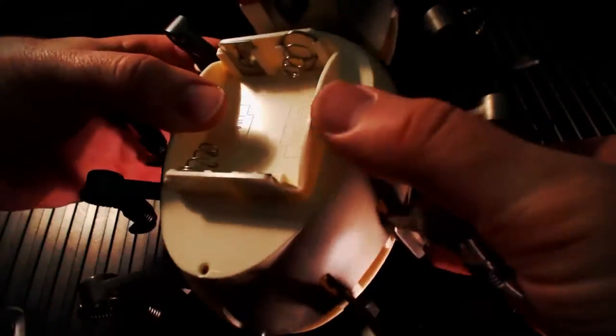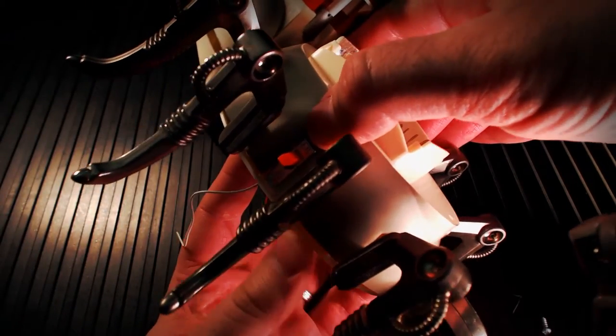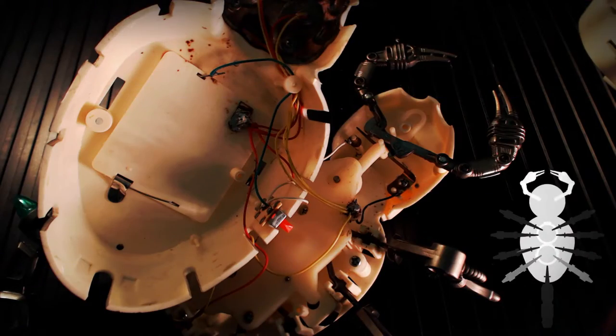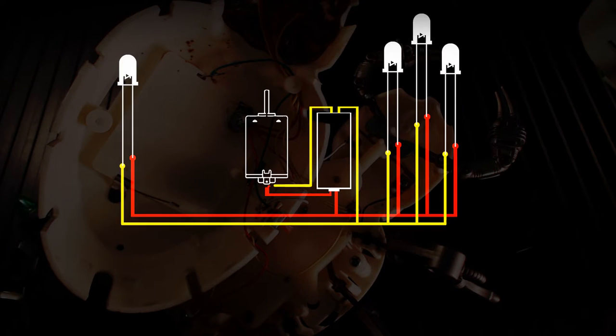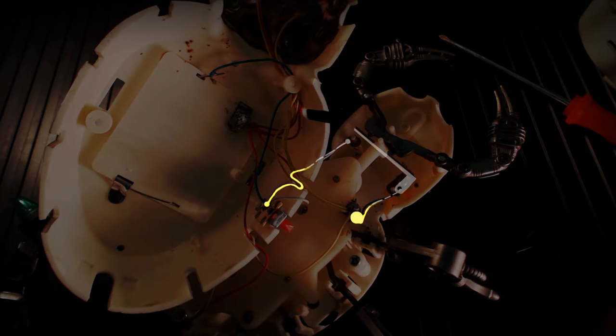Closing the toy up, I'm being careful not to destroy any of the wiring, and the on/off switch has to thread through a little slit in the bottom — you don't want to bend that over while closing it. I reinsert the body screws and lightly tighten everything. I took the toy downstairs and soldered the broken motor lead. The motor works fine driving the bump-and-go feature and turning the decorative motion cam gears at the legs, but the light feature isn't working. There's a metal flap switch that turns on and off when the front arms scissor to control the lights. There must be a fault in the wires leading up to it, so I jumped over that circuit with a wire. Turns out all the lights do work, so I replaced both leads to the flap, which repaired the issue. The vehicle works fine.